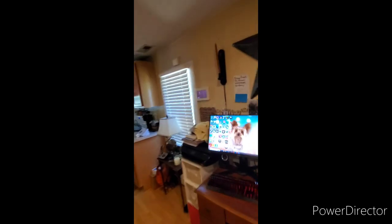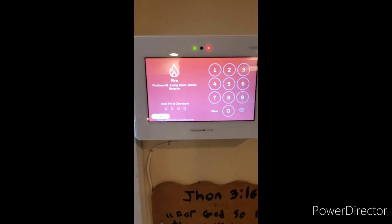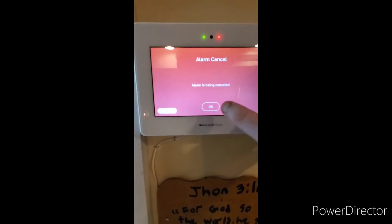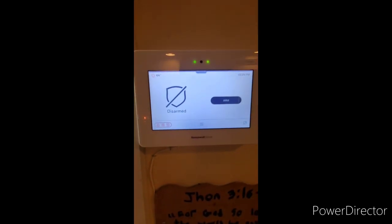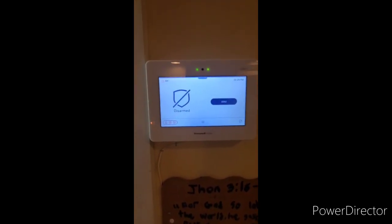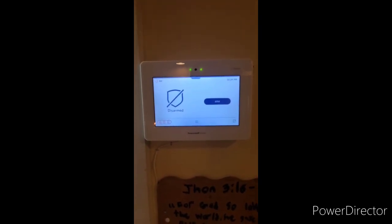The system will sound. Fire alarm — living room smoke detector. To cancel the alarm, enter your four digit code. Disarmed — ready to arm, and press ok. If this was a false alarm from cooking, or you tested the alarm and forgot to put it in test mode, call your central station to avoid a dispatch, or await the fire department with your identification and let them know you are simply testing the system.